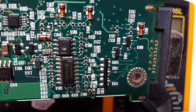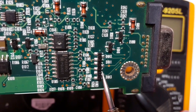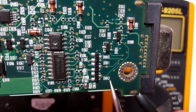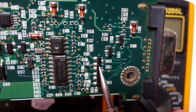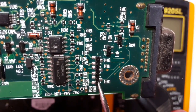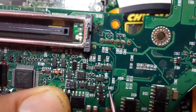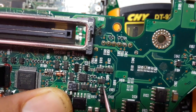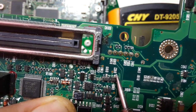Now let's pass to double diode testing — double SMD diode testing. As you can see, these are basically diodes, not MOSFETs, not transistors. As you can see, we have D here, which means diode. These three are diodes — three terminal diodes or double diodes. Here, as you can see, we have Q, 1030 Q — this is basically MOSFETs and transistors. So always pay attention: do not confuse between double diodes and transistors and MOSFETs.